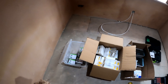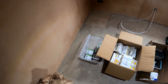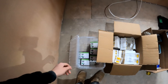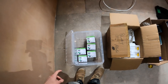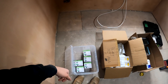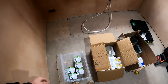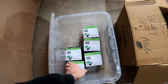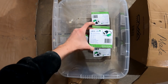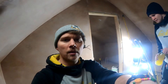I've just finished doing the little bits and bobs like the smoke alarm, the fan iso, and the other switches. Still yet to do the intermediate, but Nick's currently started the bathroom lights on the top floor. My hand reaches up into the downlight so I've managed to grab the cables, and Nick's in the background cutting the other downlight holes. We'll get the top floor fully done and then bring everything down to this floor. We're fitting the JCC fire-rated GU10s.